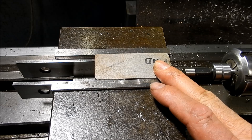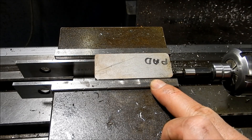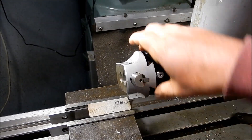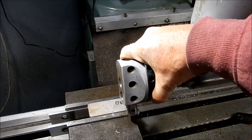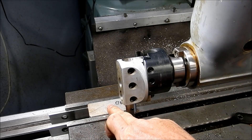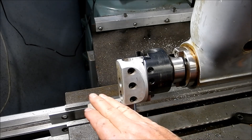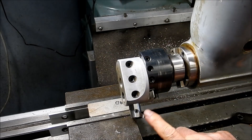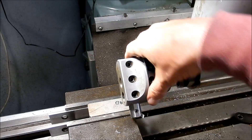We'll set up now with the boring head and set a radius on that - it's 71 millimeters, and we've just got to lick out to the sides of the plate. So this is the setup and I've got this tool just touching the top - we're exactly 71.045 millimeters off center. We'll bring the table up to cut our depth. I don't have any carbide cutters I can find, so I have to try high-speed steel and just see how it performs.